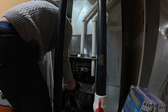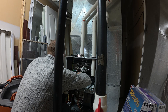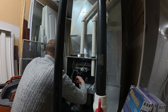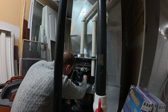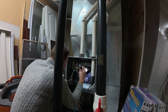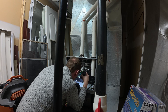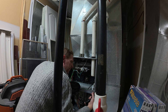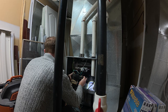Long story short: I sucked out all the water from the different places it would collect — in the motor, in the area where the fins are in the furnace itself, and in the various hoses that connect to the pressure switch. I also made sure that plastic seal was fitted back into its three demarcation marks properly. Looking into the fins in the furnace, I saw a fair bit of water in there. That's just condensation — if you have a lot of moisture in the air, it collects in there.